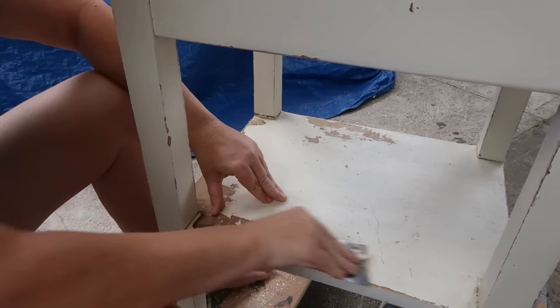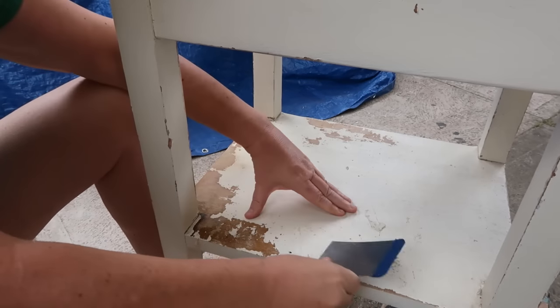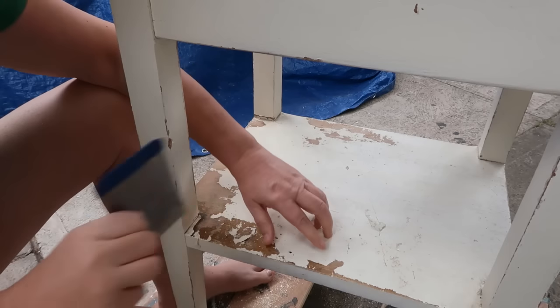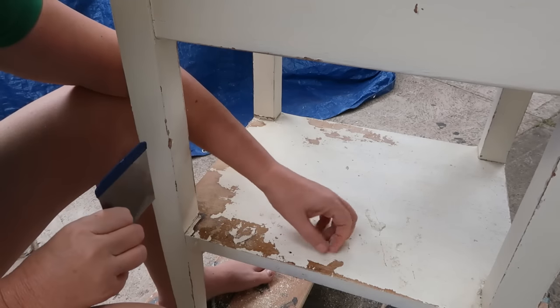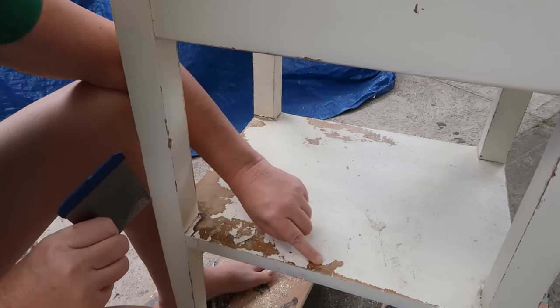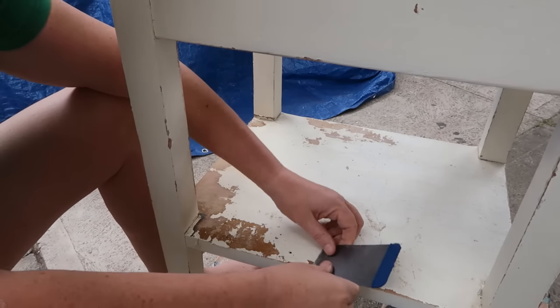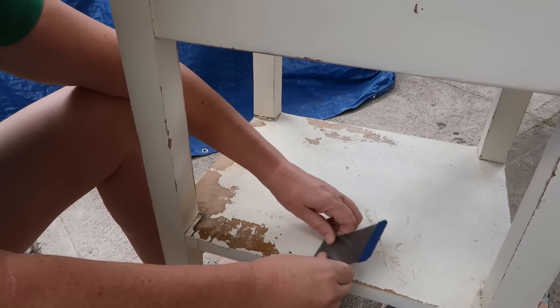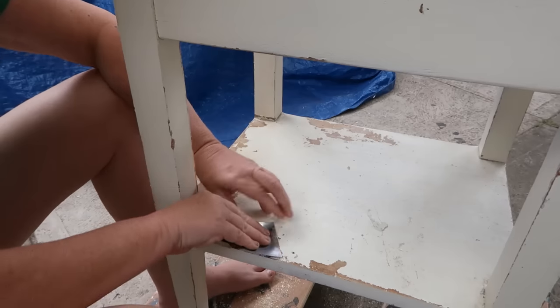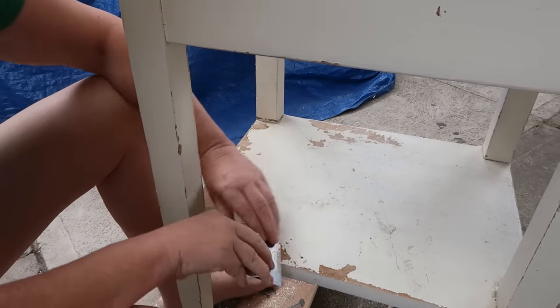Yeah, so like I said, my aim isn't to get it all off. I just need to get everything that's loose off and also not have any harsh edges. So it needs to then be smooth sanded, the wood to the paint area, so that you're not going to see any marks from it, but also it's not going to be encouraged to sort of lift over time.